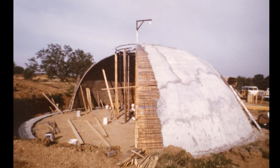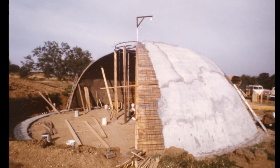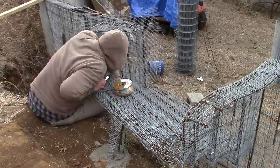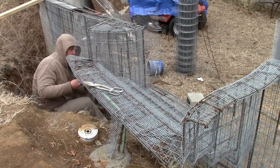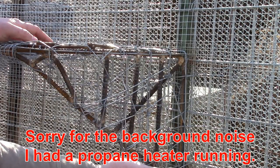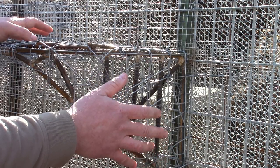There's a lot of experimenting going on with ferro-cement design. When you're placing your metal, just do whatever feels right to you. On my stairs I went a little heavy with the metal, and on the wall a little bit light, but I'm confident it will all work out. Here's a quick time lapse to show what I do — I just tack up a piece of metal, make it work, then start anchoring it down, cutting, making reliefs, folding it, whatever it takes. I think this is way overkill and I'm getting away from the original spirit of ferro-cement, which is supposed to be minimal and as cheap as possible.